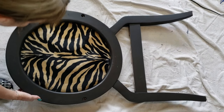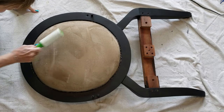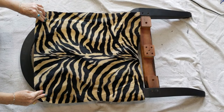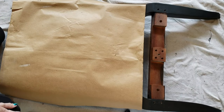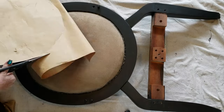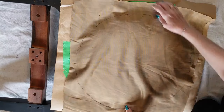Now we're going to apply fabric to the front of the chair — flip it over. It's a good idea to give it a bit of a lint brush before applying the new fabric or spray adhesive. I pre-cut a piece of fabric to the correct size, taking into account the nap and the pattern. To protect the wood trim that's already been painted, I used a piece of packing paper, laid it on top of the chair, traced around the raised portion of the cushion, cut out the inside section leaving the outside intact, and taped it around the cushion, using masking tape to fill in any gaps.